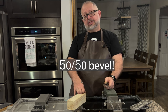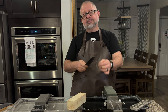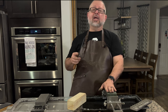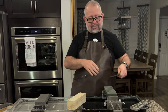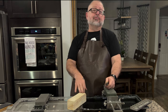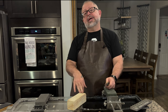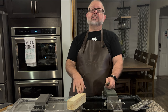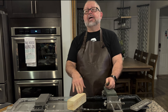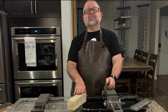The last method I want to share is a bit more tedious: once you're done sharpening one side and you've got the burr, take the time to remove the burr from that side. If you don't have the burr hanging over, when you go to your opposite side you'll create a brand new burr that hasn't been flipped over — and by doing so you know you've ground the other side the same as the first. It does take more time, and as you move to the next stone you're constantly removing the burr, but if you can't count strokes or remember what you did last time, it's a reliable way to get it done.